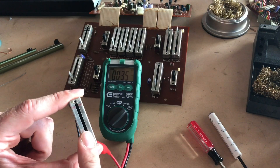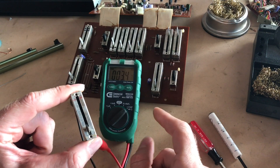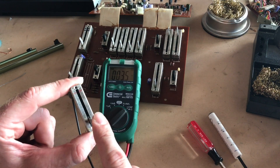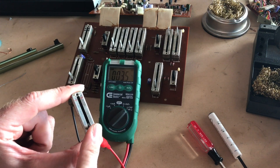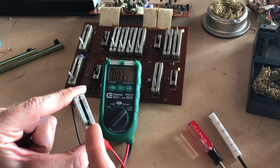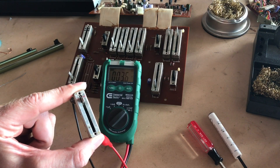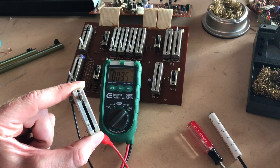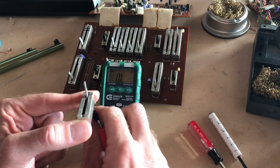Okay, I've got this resonance fader pulled out and hooked up to my multimeter. The service notes for this keyboard say this is a 100k slide potentiometer. Right now I'm showing 3.5 ohms and it's very stiff and hard to slide, and it is not changing the resistance. So something is up internally — this one definitely needs to be taken apart and cleaned.